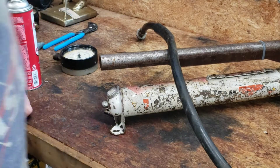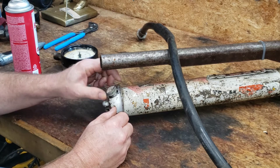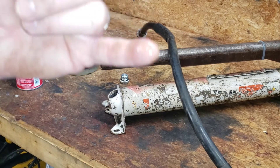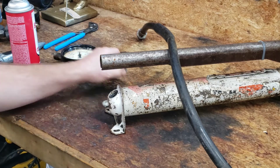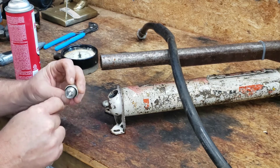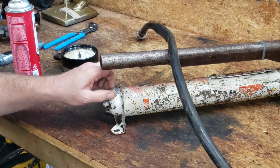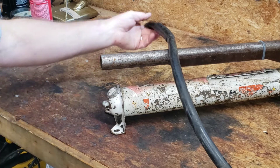I got the filler cap loose and I wanted to take a look inside — see if it's nasty. Man, look at that — it's actually really clean. The hydraulic oil is clean as a whistle. So either someone serviced it or recently filled it. These little caps have a breather hole — you can see it right in there, and it comes out underneath the O-ring. I've read that when you operate one of these you should back the filler cap off just a little bit so you don't create a vacuum in the pump while using it.